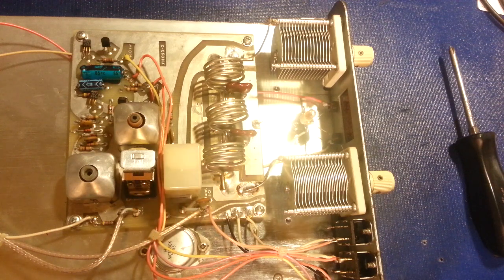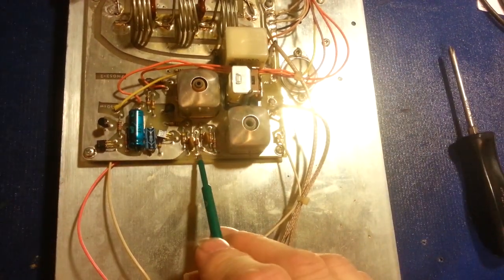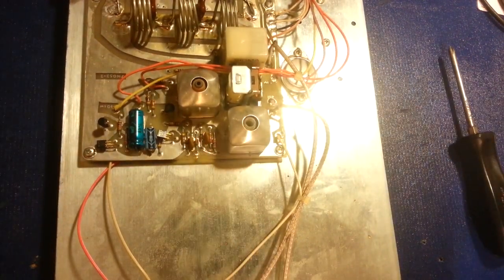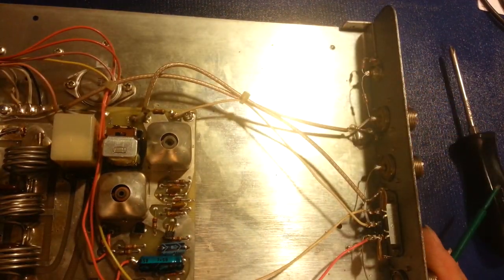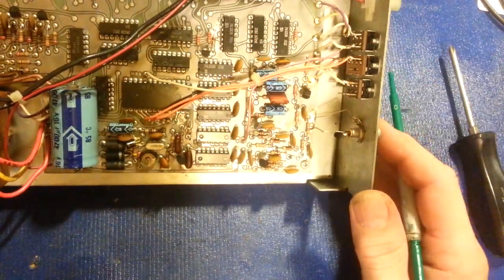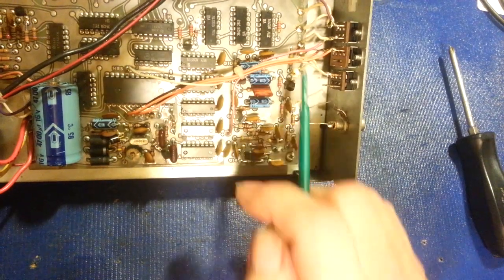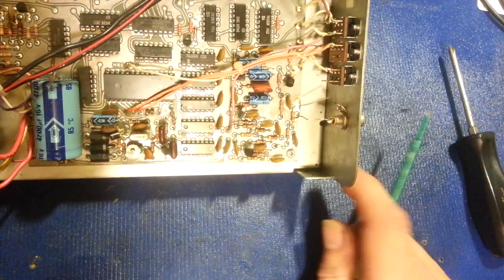As long as the relays are fine, there's no reason to go changing it just so it has the cover. But I can see, again, this has been out. Actually, it looks like this diode here has probably been replaced, because both sides have been resoldered. Like I say, this has had a little bit of work done to it. It doesn't look like it was soldered exactly properly, but I've seen a hell of a lot worse, I'll put it that way. So I can see a lot of this was unsoldered, pretty much everything along the backside here. So yeah, somebody's had this board out before.